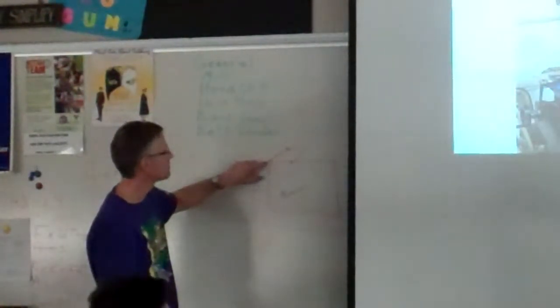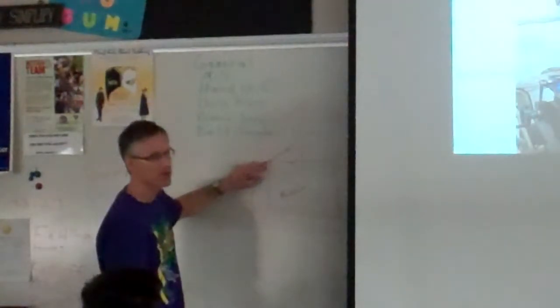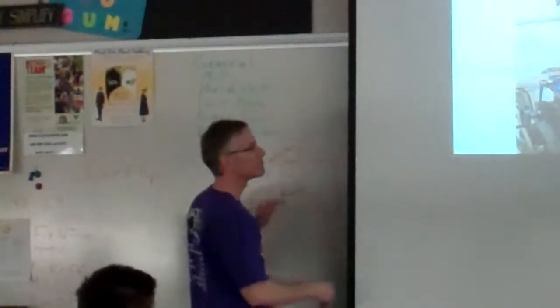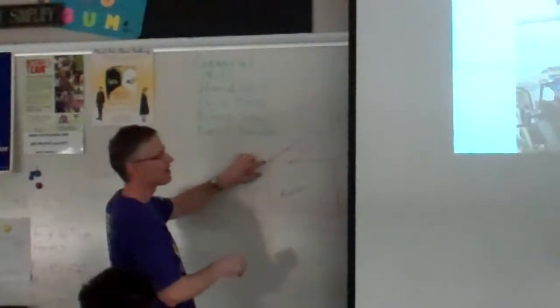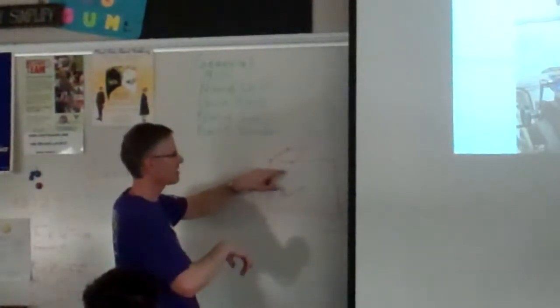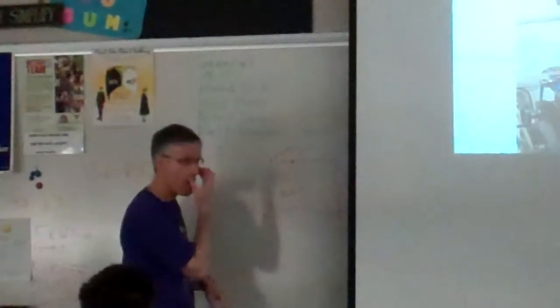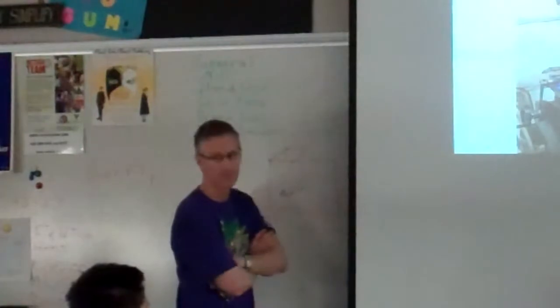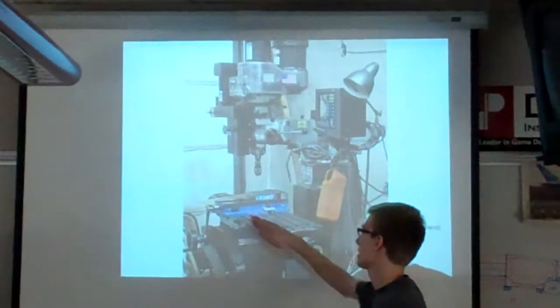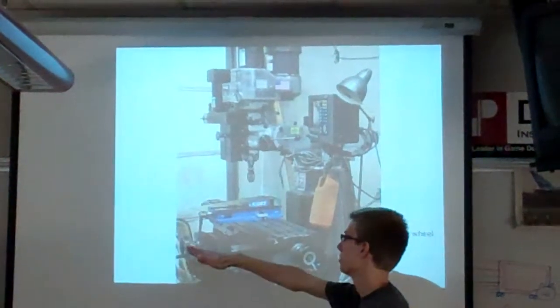Using the 0, either on a face or in a corner, okay? You can set that up so you can zero your digital readout at this point, and you'll always know how far you traveled in one direction or the other, X or Y. Okay? Oh, and to control how these move, you rotate these wheels. This one controls the x-axis. This one controls the y-axis.